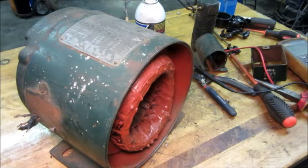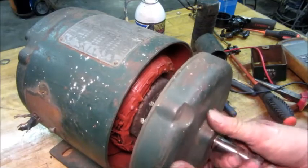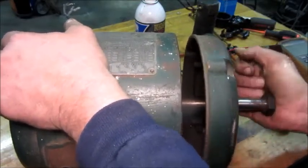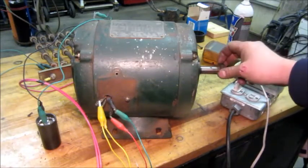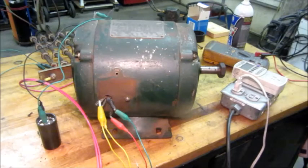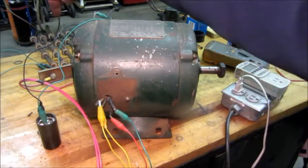I'm going to go ahead and put the rotor back in it. It was apart when I went to this guy's place — I wasn't the one that took it apart. So let's just hope for the best. The Do-More grinder motor is back together. Shaft turns freely. I put a little bit of oil on those bearings — they're ball bearings, so they'll need grease or need to be replaced because they're rough, but I didn't want to run them dry. I've got a capacitor hooked up. That grid thing you see in the back is the heating element for a current limiter. The wiring is atrocious, so I'm not going to be touching the motor while I try to run it. This is a 120-volt configuration and 120-volt power with the full resistor in series as a current limiter.